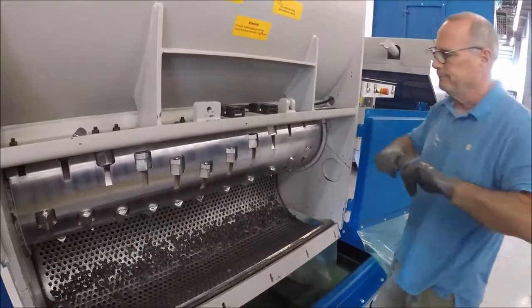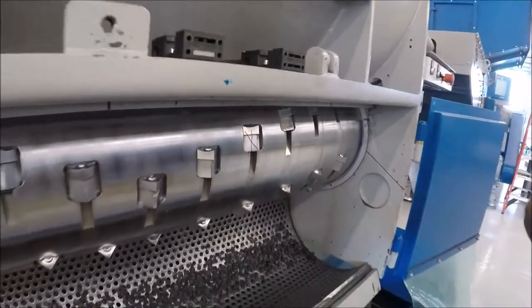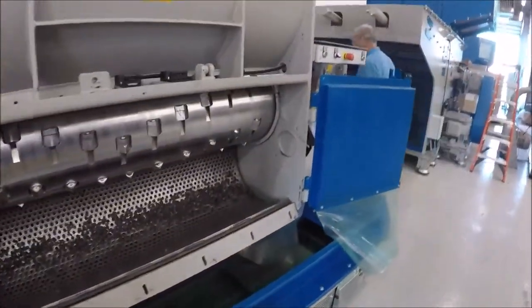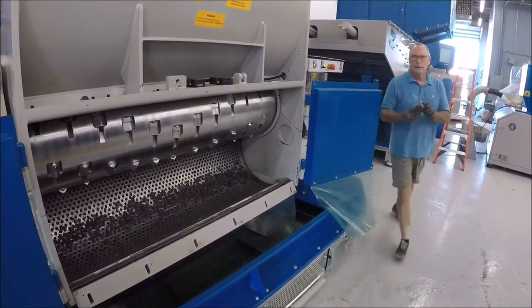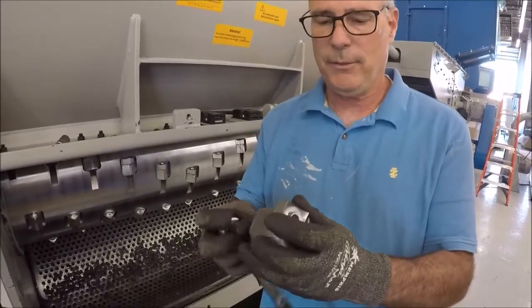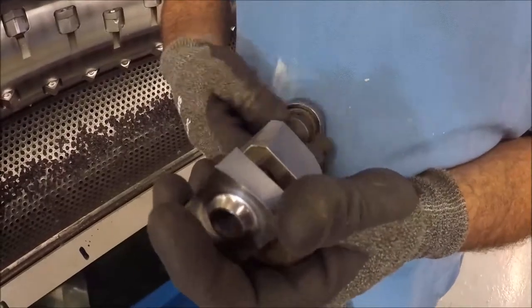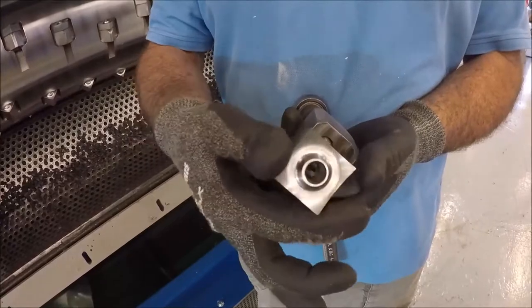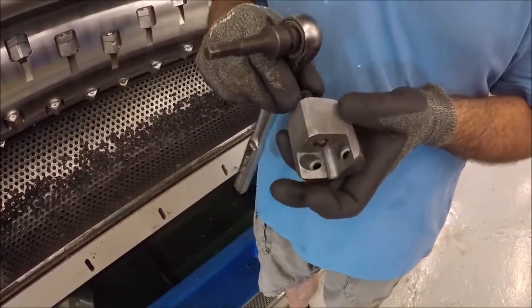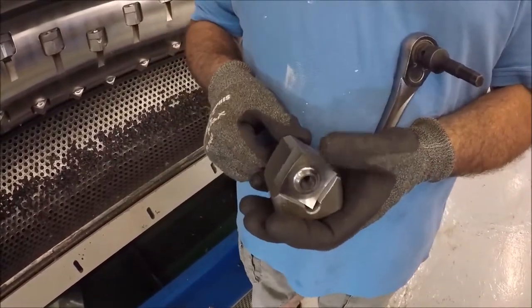Now you have a nice clean surface — you're taking away any contaminants. Putting back the knives, when you put it back in the first time, mark it. And then when you torque it, put an X. That means the knife has been changed, turned around, and torqued back into position. This is what a knife looks like in a knife holder — all locked in. You unscrew the knife, turn it around, clean out inside the pockets of the knife holder and the back of the knife hole, then put it back in, rotate the knife around one turn, and bolt it back down.